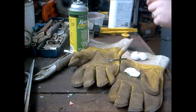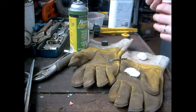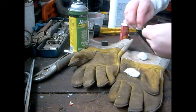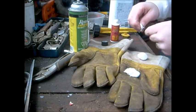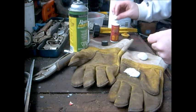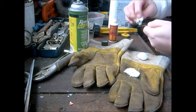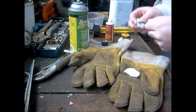I'm just gonna hit it with a dry cotton ball — that'll be good for degreasing. Then some Outers gun blue. I don't particularly like this Outers stuff, I find it doesn't do a very good job, but it's fine for small parts. I would never try to do a whole gun with it — it's just not possible to get it even.